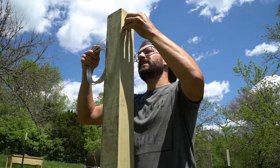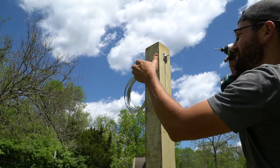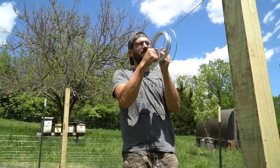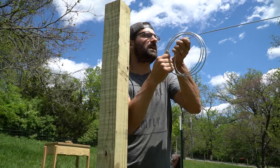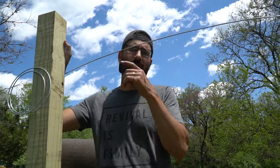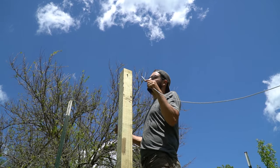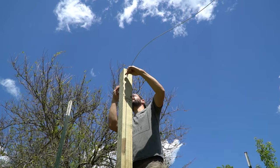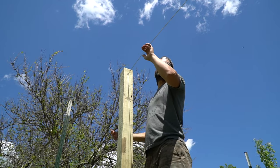Unroll just a little bit of your nine-gauge wire, send it through the inside of the post and out the back. Once it's out the back, take your wire vise and push it right on there through the hole, twist it around — sometimes it gets stuck — and just like that it won't come back through. Then take your two screws and knock that into the post. Now it won't pull back through. This is pretty heavy-duty wire so you need to walk it out — just unroll it as you go, walk it all the way back to the other side, loop it around and keep it there. Then drill the second hole and send the wire through, connect the vise on that side, and pull it as taut as you can. Then screw in that side.